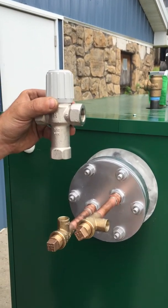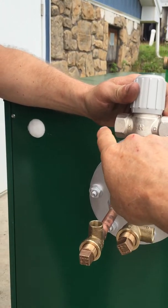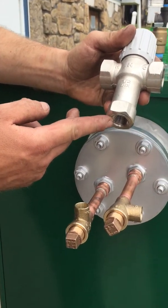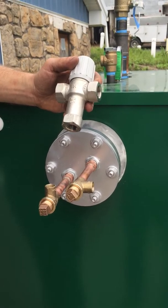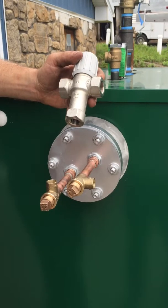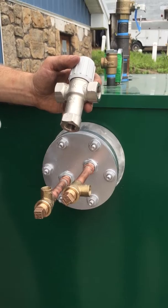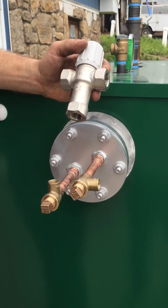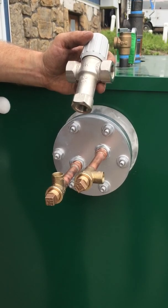This is not shipped with the Keystoker unit. The way it works is you have your domestic cold water coming in and your hot water coming in from the boiler, and it mixes the two together to maintain the correct temperature — to avoid scalding. Keep in mind the minimum temperature on this boiler is typically 140 degrees, which is much higher than what your hot water tank is usually set at, typically 110 or even less. So you need a mixing valve to prevent anyone from getting scalded.